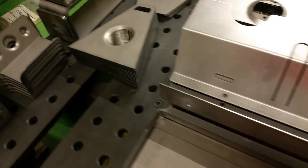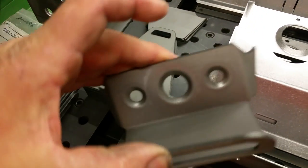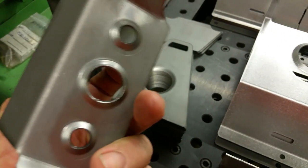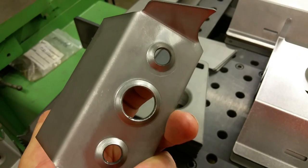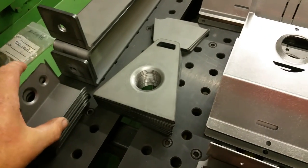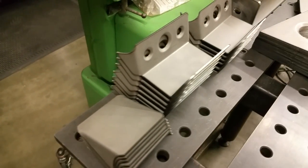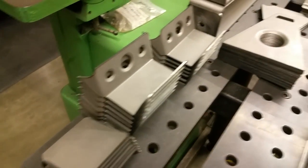Easier to ship too. And you've got a lot of dimple die features on them? We do all of our dimple dies on our 50-ton Dake press. That adds strength to the unit and gives it a little bit of style. And as you can see, the way these things are stacking up they're just mirror images of each other — just carbon copies.